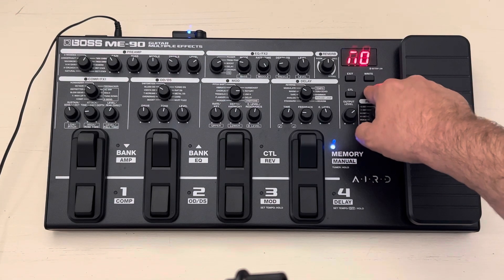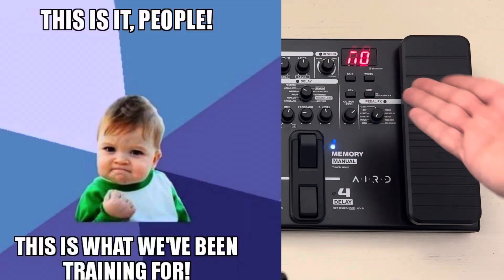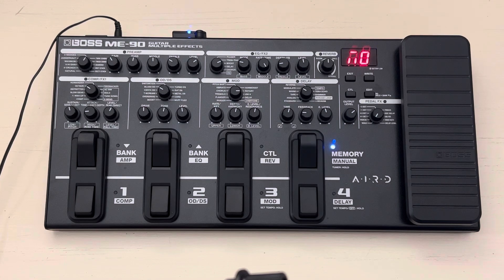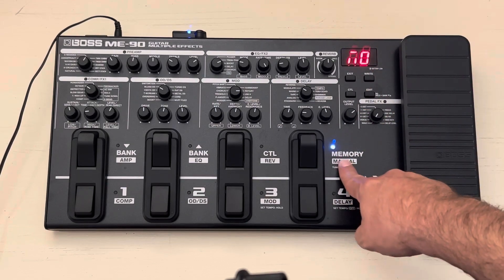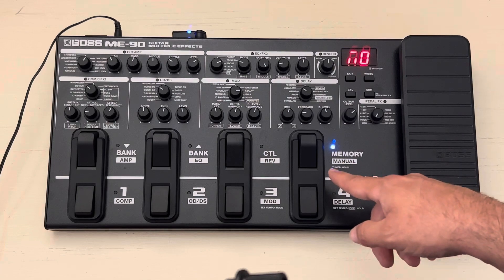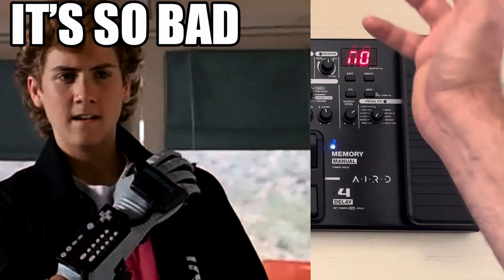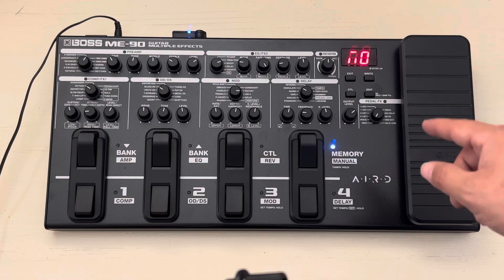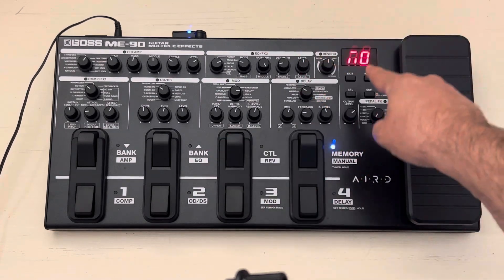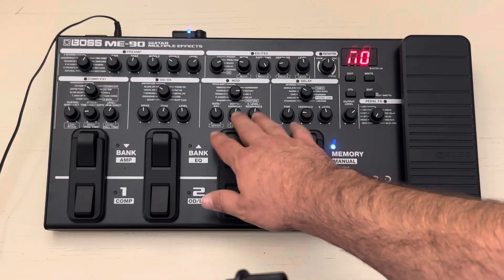What we were talking about is getting all the way to this setting — this symbol that looks like a strange pi or almost an N — and that's the one that deals with automatic presets versus manual mode. This is how you set it if you want to turn it on in manual mode. If you go to N1 it goes to memory mode, and the factory settings carry over — so every time you switch something the levels go all over the place. Keep it on this setting to even things out and keep it where the knobs actually are.